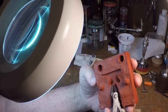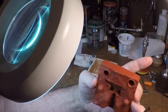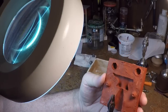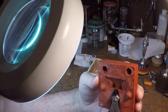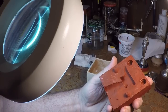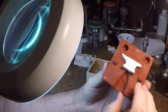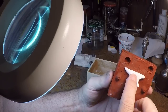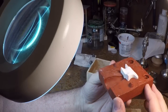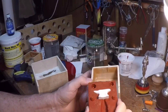Examining it under the glass — it's a really clean mold with very little flash around the anvil itself. There's some around the sprue, but that's not a big deal. I'll just use side cutters or a razor blade to nip that out. The pattern fits in there very nicely, and that's the value of spending time carefully setting the piece into clay — you get that real nice joint and minimize cleanup time.